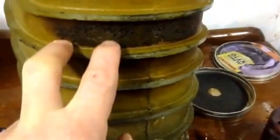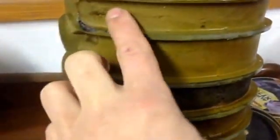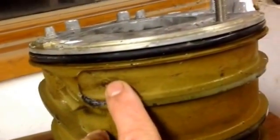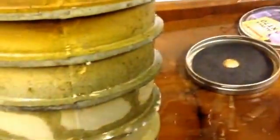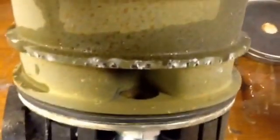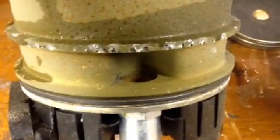You'd expect a bit of a burn in there. None of that's obstructing. But you can see this right here, where that piece of tube comes in — that is the worst possible place to get blocked up. Right there. And that's where you're looking to clear. Other than that, the rest of it's all quite wide, all quite open. And right down the bottom there, anything that tries to choke that will just go flying out and into the pipe below, so it's unlikely to get choked there. There's plenty of room.